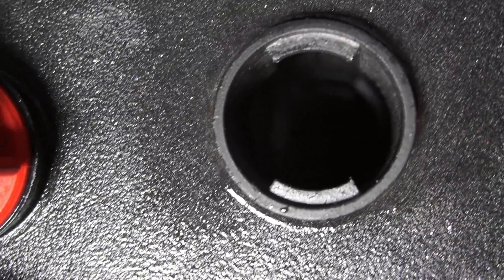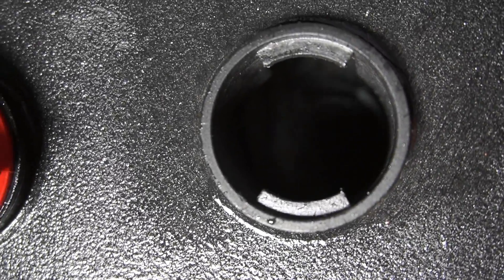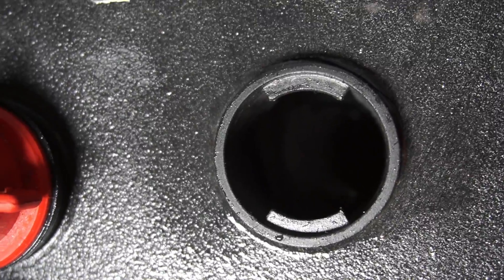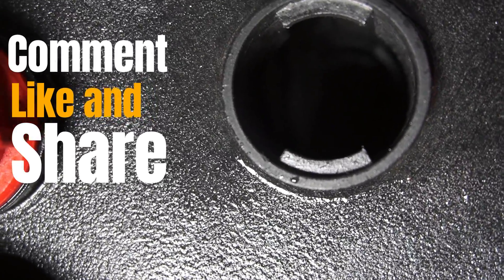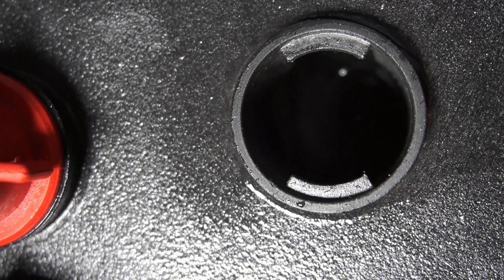What I noticed is that because the OPZ batteries are less amperage, they fill up faster. If you look — I've been able to zoom in — you can see that the OPZ battery is bubbling. It's already fully charged. Now let's see what's happening with the ROSERED battery. You can see the inside of the ROSERED battery is quite calm — nothing is going on — because it's not fully charged; it's still getting charged. Meanwhile the OPZ battery is already fully charged. There's just a little bit of chemical reaction here, but it's quite calm compared to the OPZ battery that is already bubbling.